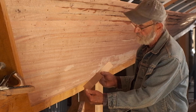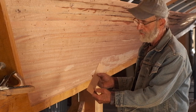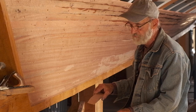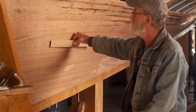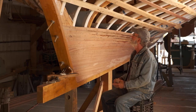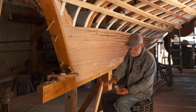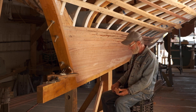It's got a nice scarf on the end here about maybe four to four and a half inches long. We've got a machine all set up — a little bandsaw that cuts these scarves. Each one of them is machine perfect, so they glue together longitudinally really nice. It doesn't create a big lump or anything like that. We don't have to touch it up with a plane; it comes out of the machine and we glue them together.